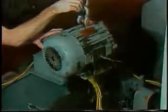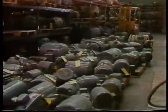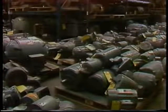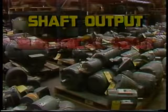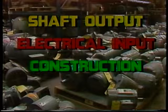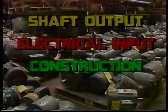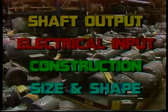When a motor must be replaced, the replacement motor must be able to do the job. In all probability it will be specified by a plant engineer, but he may only indicate a general motor type and horsepower rather than a particular make and model. It may be up to you to make sure the actual motor you have will work. It must have the right output characteristics to drive the load, operate on the available electrical power supply, be at least as rugged as the replaced motor, have the right type of construction, and mechanically fit the environment it will work in. To know whether you have the right motor, you need to be familiar with the specifications on its nameplate.